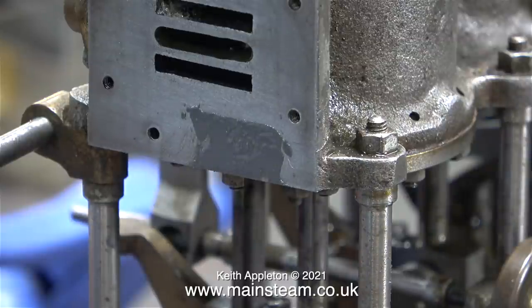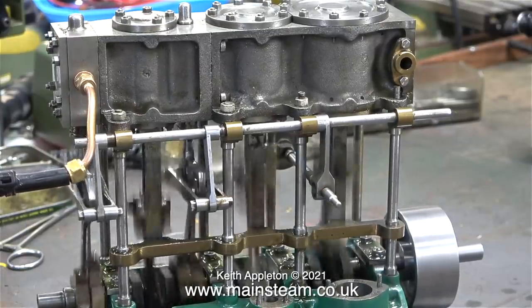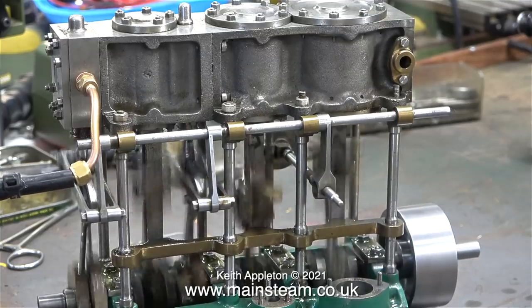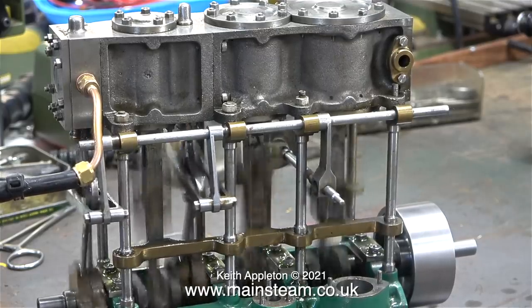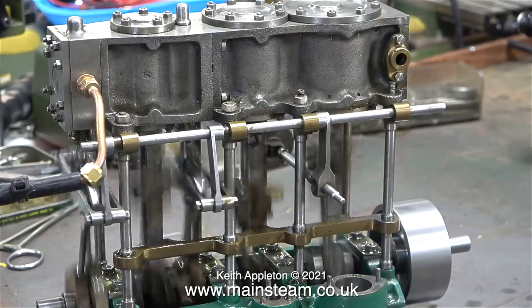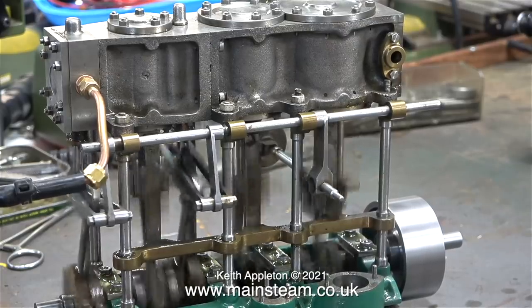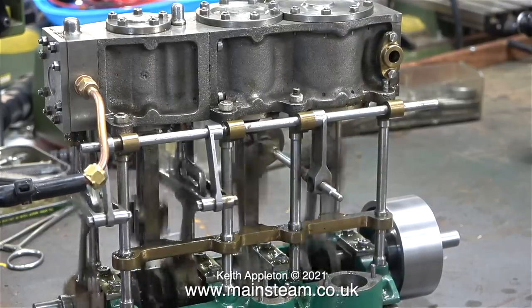There were some imperfections around the edge of the thread so I used some JB Weld to fill these in. After doing this job I really did need some entertainment, so I ran the engine for a while in both directions and it still worked OK - which is quite good considering it's only running on the first cylinder, the left-hand high pressure cylinder, and the fact that it's dragging the other two along. It's surprisingly powerful.